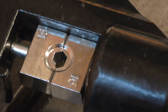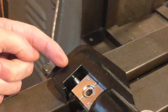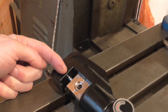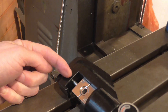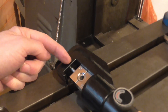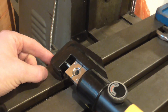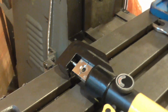So this is a relatively easy fix I think. I've just got to drill through on centre and then put a sleeve in to get the hole back where I want it. These use a magnet as standard to retain the die, but I've got no problem drilling a hole through the side and using a little grub screw. I can always make a little thumb knob to operate it.